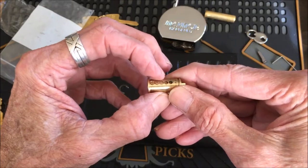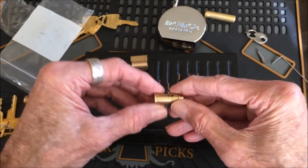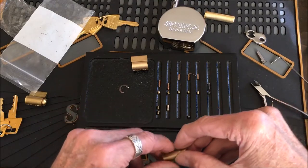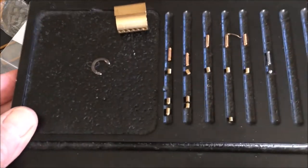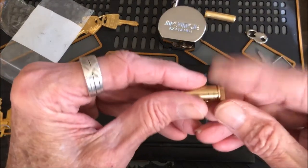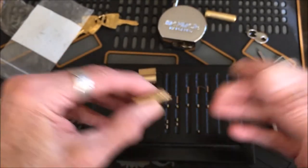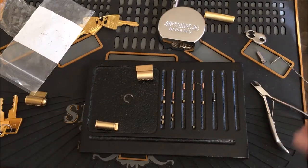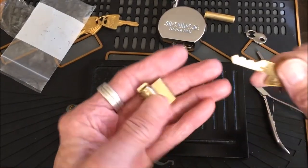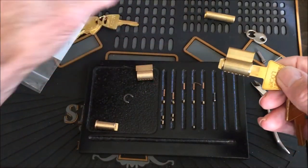This is really interesting — you almost only pick two pins; the rest are just at shear line and are all basically standard pins. Just standard pins. There's one little ball bearing detent in the back — just a little bitty dent — and that's the security of this lock. We'll be replacing it with an American lock core — a real one that's pinned up with security pins — and that should turn this into a pretty decent lock.